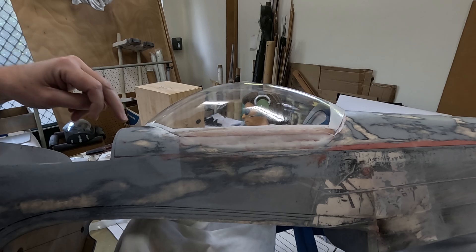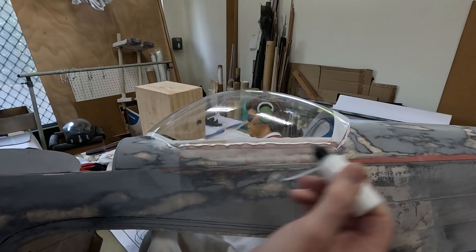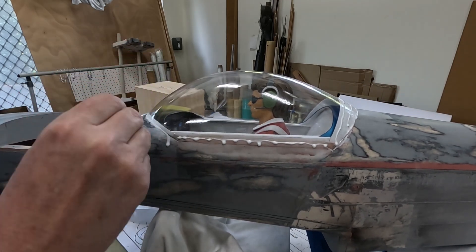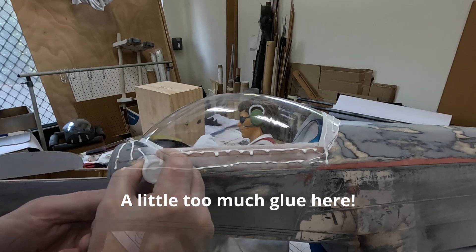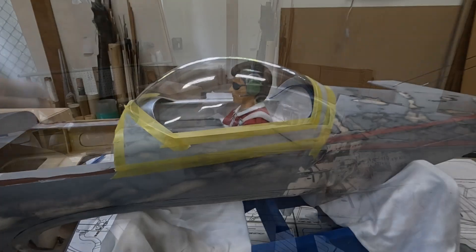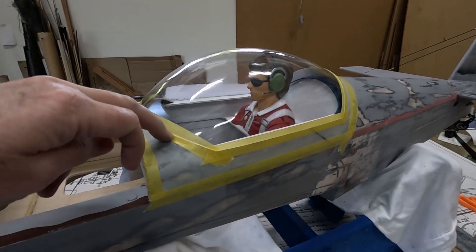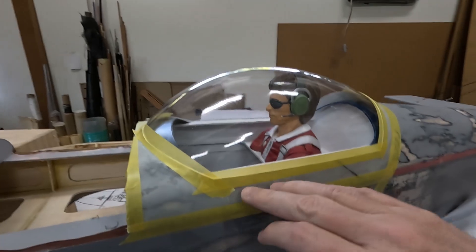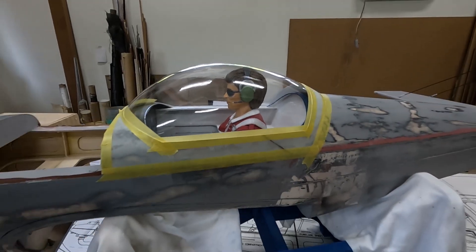My plan is to glue right along the edge and along here, but staying away from the edge where the framework is - I don't want glue squeezing out especially up at the canopy. If it comes out along the sides I can clean that up. I like to keep it as clean as I can. It's all taped up and I'll let it sit overnight to fully dry before working on the other side. I use my fingernail to burnish the tape down into the seal to keep squeeze-out from pushing up onto the canopy. We'll see how well I did tomorrow.